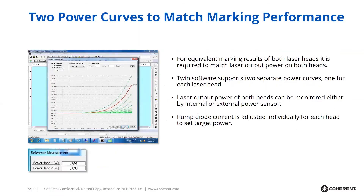It is also possible to adjust the performance of both lasers individually. It is very critical that both lasers produce comparable marking results. For example, lasers typically lose some power over time and you have to compensate by increasing pump current. Both lasers have individual pump power curves, and therefore the software allows individual adjustment of output power.